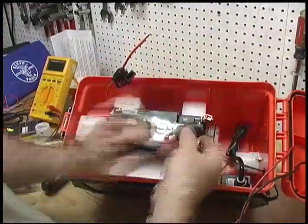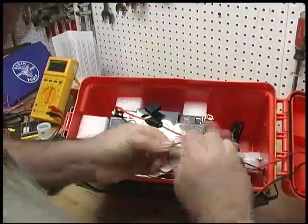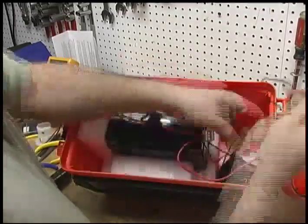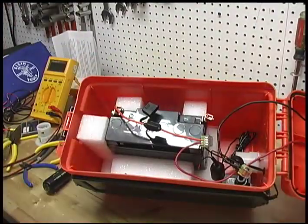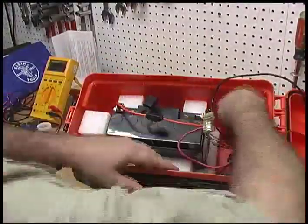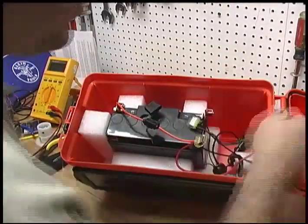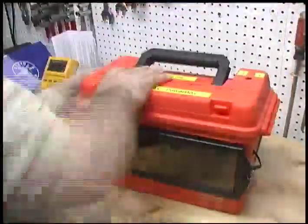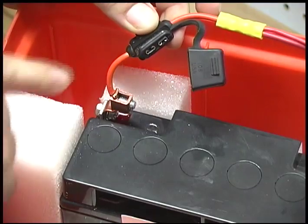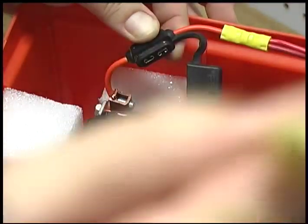I'm combining the positive wires from the jacks, the positive wire from the solar panel, and the positive wire from the trickle charger into a single fuse holder. I'll repeat this process for the negative or black wires, bringing them all together using the Ideal quick connector, then connecting the single black wire to the negative terminal of the battery. Note that there's no fuse holder on the negative side — this is normal. Now it's time to insert the 20 amp master fuse right at the battery. If there are any mistakes or shorts, they'll be apparent when you plug the fuse in because it will probably blow.